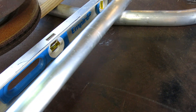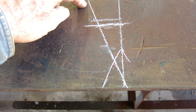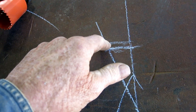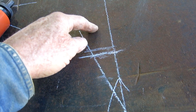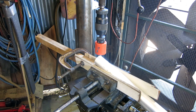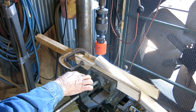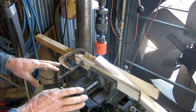I don't have a milling machine, just a drill press. I turned my 20-degree angle and measured over four and a half inches until I got to an inch and a half. So if I put an inch-and-a-half shim under the pipe in the drill press four and a half inches from one edge, I should get pretty close to 20 degrees. Here's my setup: the aluminum is touching here, and then I came over about four and a half inches and put a piece of two-by - which is an inch and a half - and that got it up to what I think is the right slope. I clamped it between some scrap so the hole saw wouldn't hit my vise.